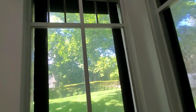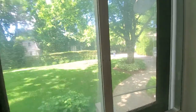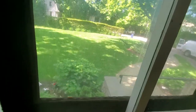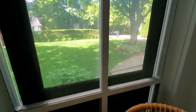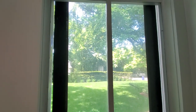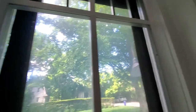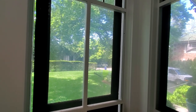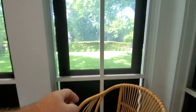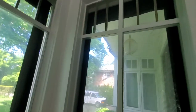Another method might be taking all of these screens out. That's a lot of labor, even taking all of those pieces of wood out. They would need to go back, even just as a substructure, if we put a flat quarter-inch mullion over that, painted white, and put a big frame over the top. The more I'm thinking about it, the less I'm liking the big frame idea. Because typical screen porches would have just one panel here with no wood on the inside — but this adds lots of character and detail, having all of this.